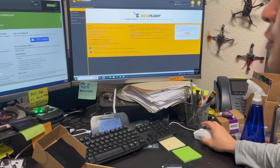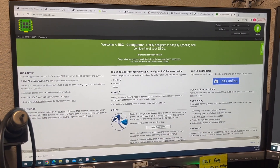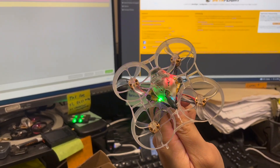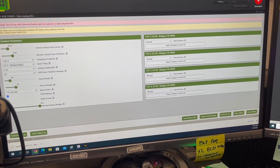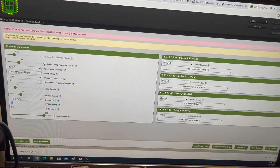To get this problem fixed, connect a USB cable, open your browser on your computer, and go to escconfigurator.com. You can connect to the ESC on your drone or flight controller and then read the settings. Now it's reading the ESC settings on the drone.